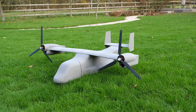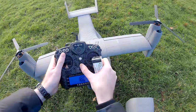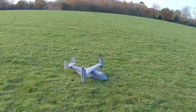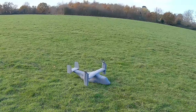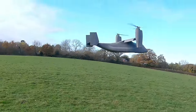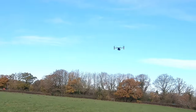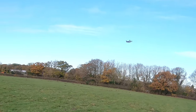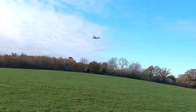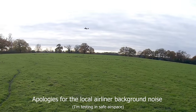Today is the day to see whether this thing flies or dies. The plan is to take off very quickly and transition to half-forward-flight mode quickly to get some air under the wings. The aircraft is cruising at much lower throttle than when it was hovering, which is great. I didn't want to spend too much time hovering because the battery doesn't last very long.